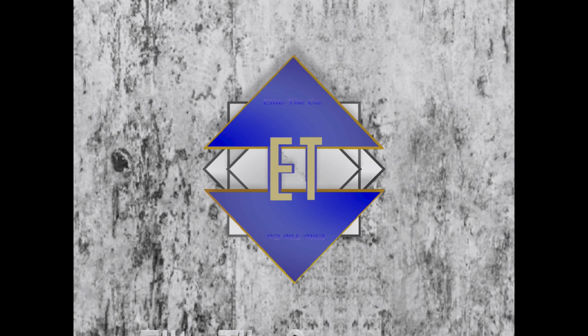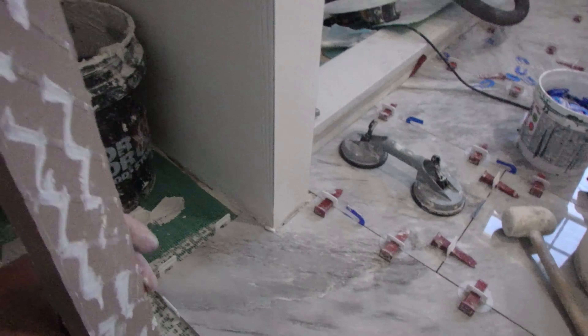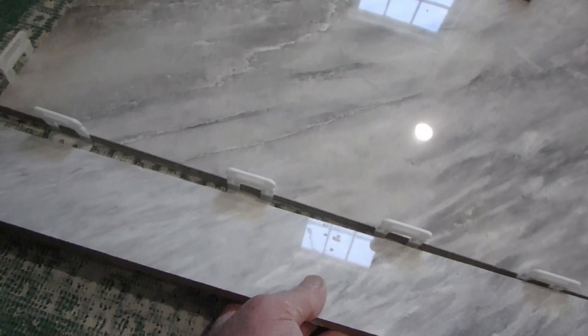Using a leveling system — here's how you set up for the next day so you can just start tiling quick and easy. See how I got this piece of scrap tile here? That's to hold the clips in place while the thinset dries, because as it dries it tends to push these out a little bit, creating a gap instead of staying tight. To stop that from happening, I put these in so they're ready for the next day, and I get a scrap piece of tile and put it in place like that.